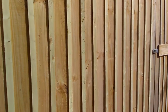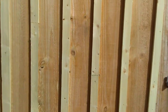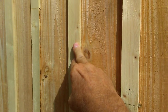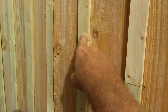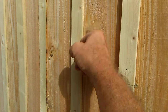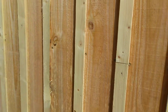A lot cheaper than any siding board that you would buy. And then for the batten, we used treated lattice strips. I also found these at Lowe's — Home Depot didn't have them at my local stores, but Lowe's did. They're thin and flexible, so they work perfect for going over the cracks in the boards.